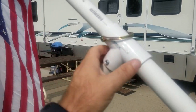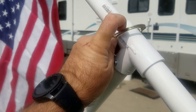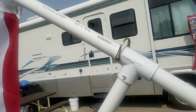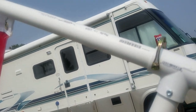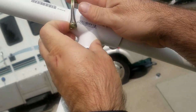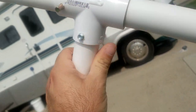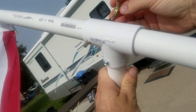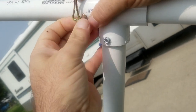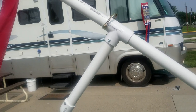I think these are called PTO pins. I'll actually put an Amazon link — I actually bought them off of Amazon. Basically the pin just pulls off like this, and the pin pulls out, so I drilled the hole all the way through, push the pin in, and then just snap this on, and that has seemed to have fixed the issue.